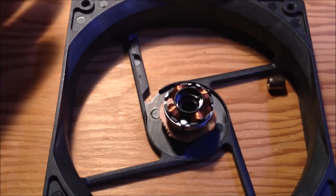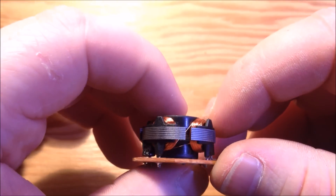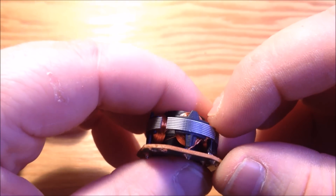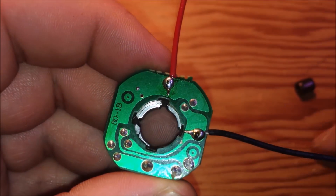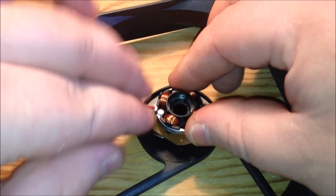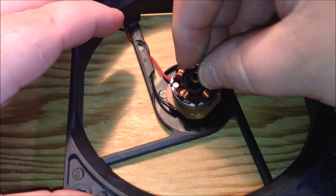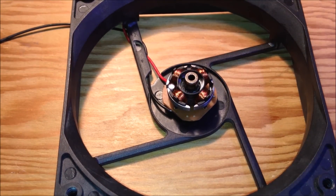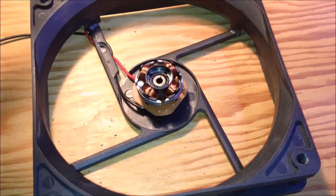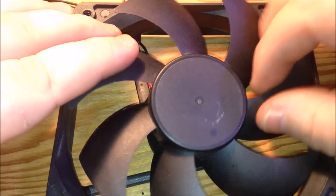So now I want to make one with the housing still intact. I have pulled the board out successfully. We're going to find our coils with the one piece of copper going to the prongs and solder our wires to those. Again, power and ground does not matter. Let's mount the board back into the fan housing and pop this back in — a nail got it out, and a nail will get it back in, but it does take some force.